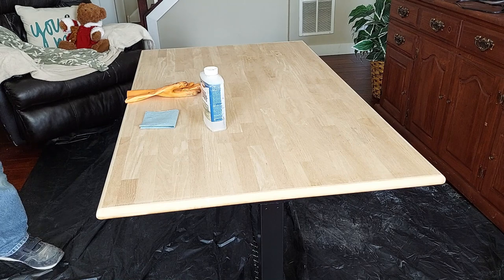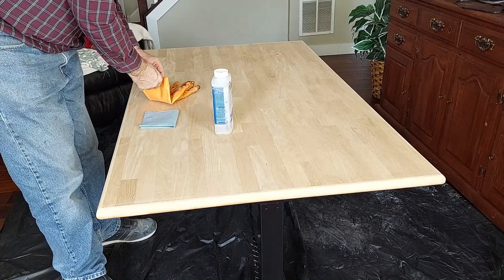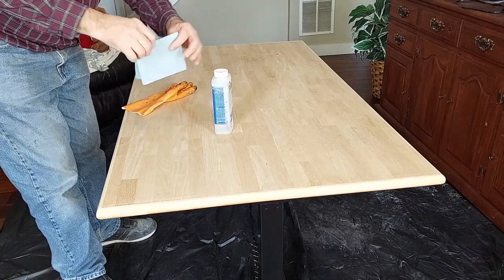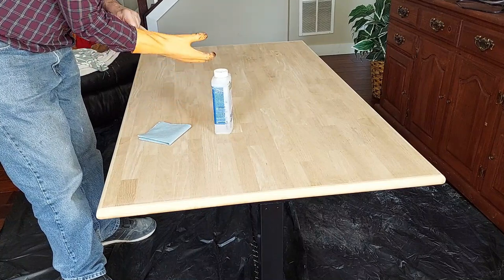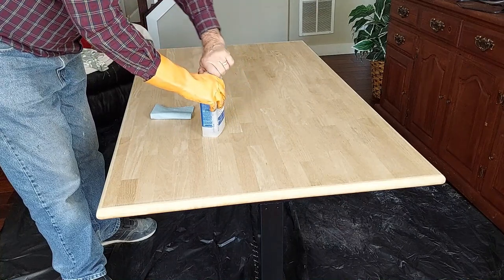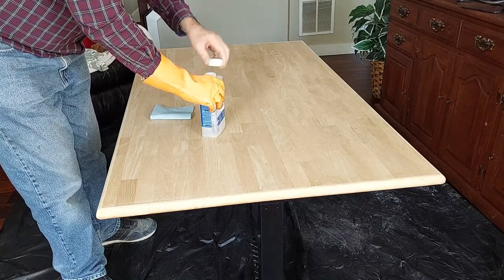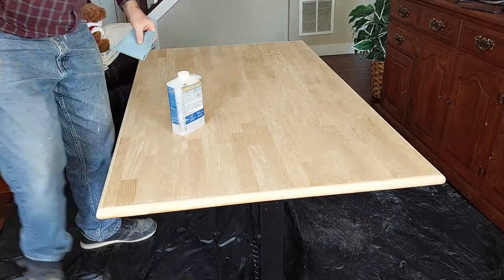The other thing that I've done is I've lined up behind me a whole bunch of shop towels folded like this, about 8 or 10 of them, just to make sure that I hopefully have enough to do the whole surface. And when you're doing a big surface like this, it helps to lay down a coat of mineral spirits, and you do have to work a little bit fast